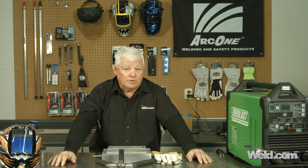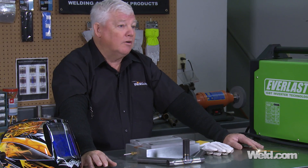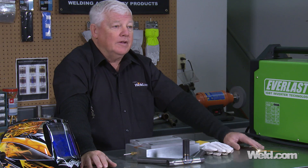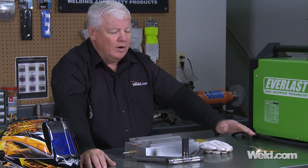And it's okay — you can get some good properties out of it, you can get good longevity out of it, unless — and this is a very strong unless — unless you understand that when you penetrate a tube or a flat sheet, on the back side you're going to get these oxides. They're called chromium carbides. Now, these chromium carbides will start cracking. So if you have that condition — for instance, if you're building an aircraft — make sure that you purge the inside of the tube. When I say purge, you need to introduce argon. Argon will prevent those carbides from forming. It's just not always practical, so if it's not practical, go ahead and use the stainless, but just know that it's going to be short-lived.